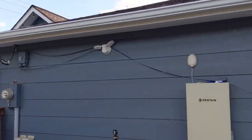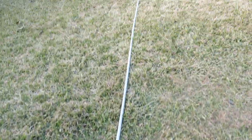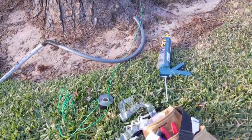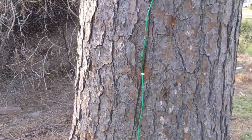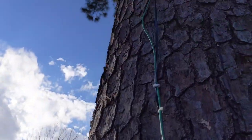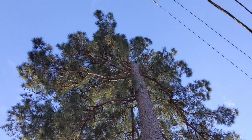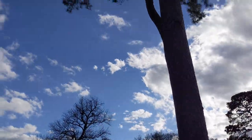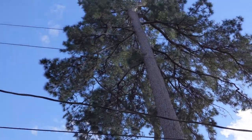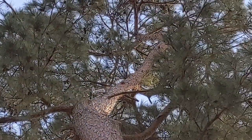This is before it's all cleaned up — we've got the ethernet running out of the garage, and we have this flexible conduit which I do not recommend because it's super hard to get the ethernet cable through. Then I have this rigid section of conduit. I told the guy to hammer the cables onto the tree with these little staples that came with the ethernet cable, but you can buy them at Home Depot. They're not actually called staples — I'm pretty sure they're called cable clips. The whole enclosure is up there; it's so high I can barely see it with my camera, but it's up there.